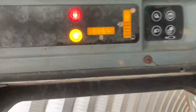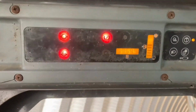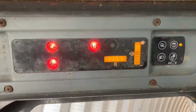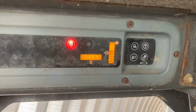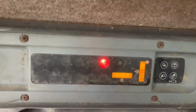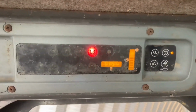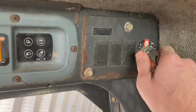All right, we got both fuel filters on now. We're gonna jump in the skid steer here and we're gonna just cycle it a few times. You can hear the pump sucking air right now. Probably can't hear it over the sound of the torpedo heater, but we're gonna let her go a couple times here. Make sure she's built up, pulled fuel through everything. Otherwise we're gonna have to bleed it out of the injectors, and that's not ideal.